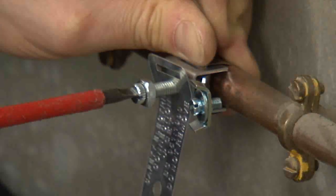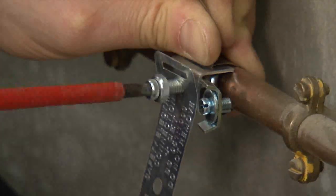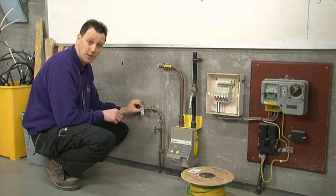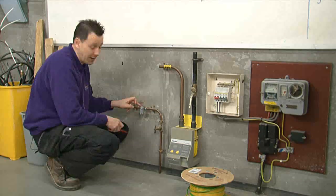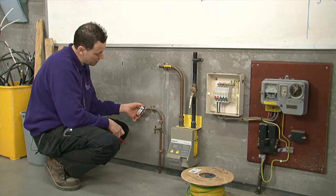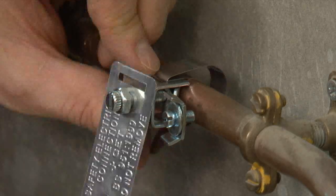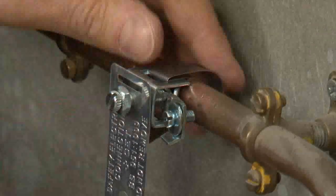Once you're holding it in place, tighten up the screw so it starts to bind and push the metal tag through onto the pipe. It's really important as you're tightening this up that you don't have any movement. Be careful not to over-tighten, as you could actually damage the pipe or the clamp. The idea is to tighten it as much as you possibly can so it doesn't move at all — it's a judgment call you make as you're installing the clamp. The most important rule is that it doesn't physically move.